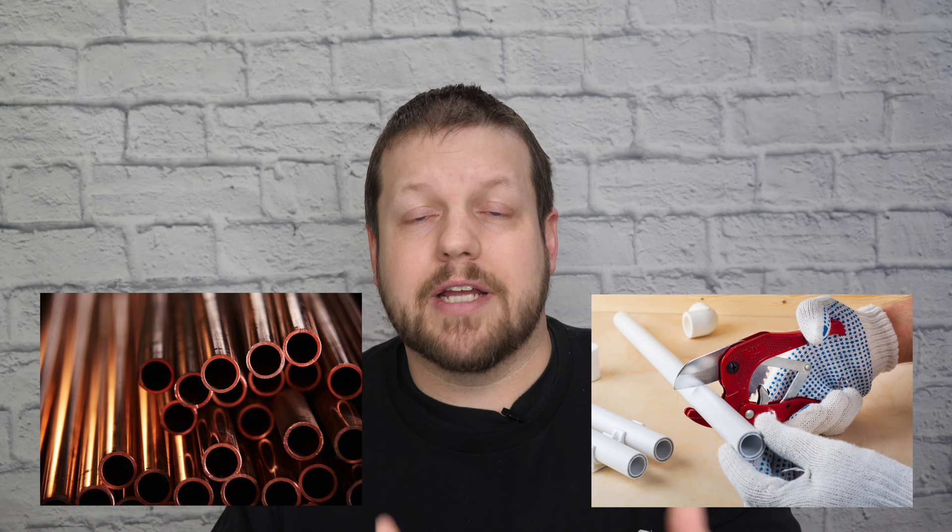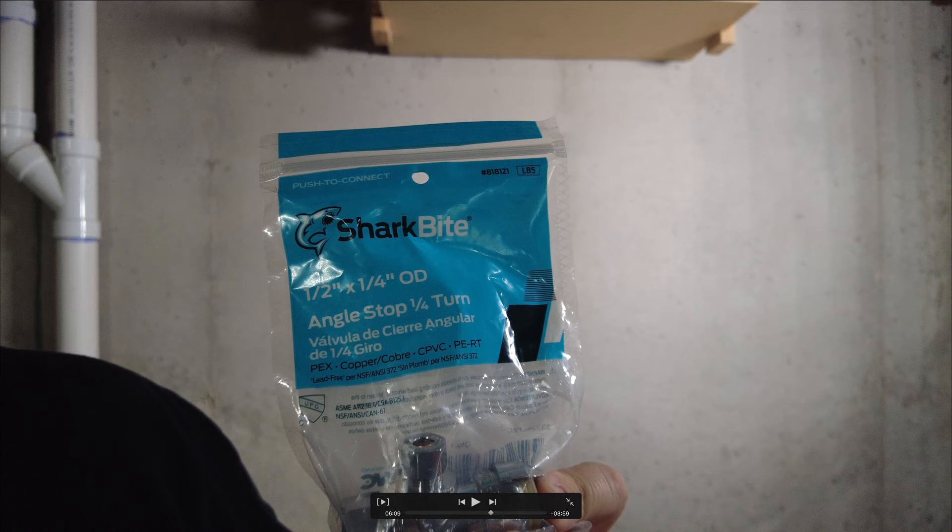If you don't have PEX lines — if you have copper or PVC — the process is similar but will take more time to cut through the lines and install the adapters. You can use SharkBite or push-on fitting adapters, which are compatible with PEX, PVC, and copper, making connections quickly. For rigid piping like PVC or copper, you'll probably have to cut a section of pipe out to get the quarter-turn valves installed. The exact fitting I used was a SharkBite half-inch angle stop with a quarter-inch compression outlet. Most RO systems take quarter-inch tubing, but some take three-eighths — check your manual or bring tubing to the hardware store.